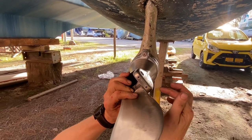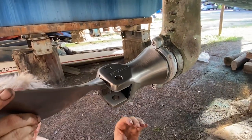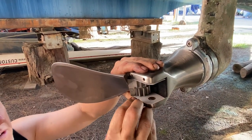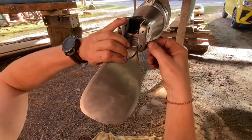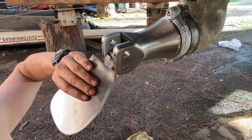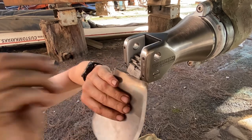We've got it in place. Behind here we have like a little flat area — we can actually use a screwdriver and sort of manipulate it to get it to the right hole. I'll get my first large grub screw, without Loctite, and feed that through first. If you have a look behind here we're not aligned — we want that aligned. The grub screw needs to go into that slot. We've got it, so it goes right inside — and that's touchdown. I'll leave that one for now and then go to the other blade.